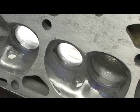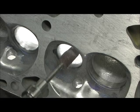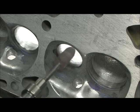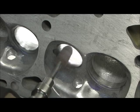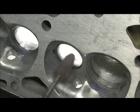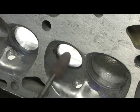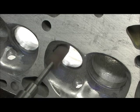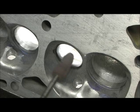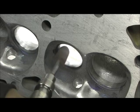I ran out of tape. But anyway, just going over it, I'm putting effort laying it at an angle and you can actually see the swipe. Then you just let it come on down and lightly kiss off right where that line is. You can actually see it — not using much pressure. All you're doing is breaking the sharp edge, then you can go up and start to pull it in.